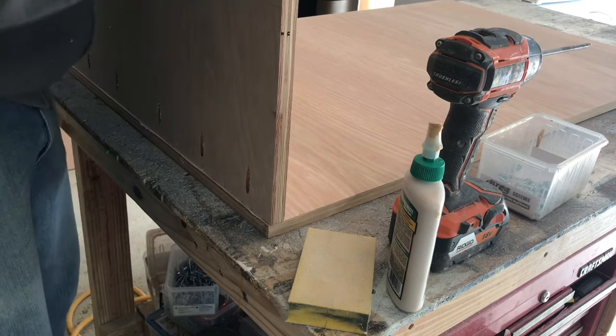Just to show you — I've got all six basket supports in on all six bays, and the back is on there. With the basket pushed all the way to the back, I'll allow myself about an inch and a half inside in case later they want to come back and put doors on it. Now I've got to put the edge banding on the front, all the way around the front edges.